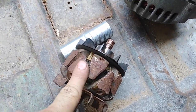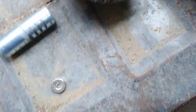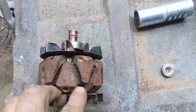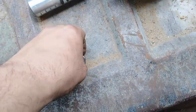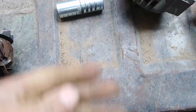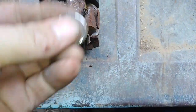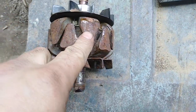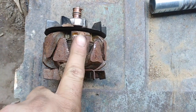That coil is what magnetizes these pole pieces. To make a permanent magnet alternator - the way I did it last time - I took a magnet and ground out enough metal right here for the magnet to recess down in there and still not hit the coils. I used square magnets last time; these are round ones but they will still work.